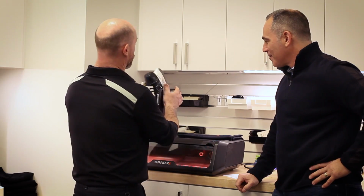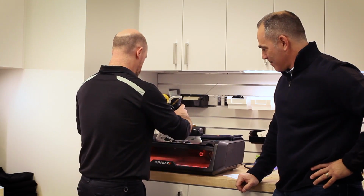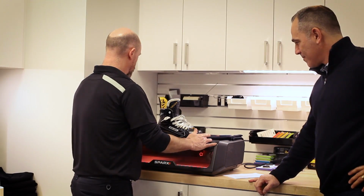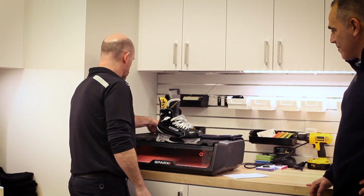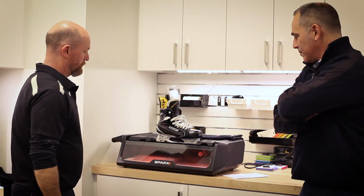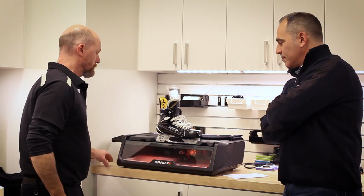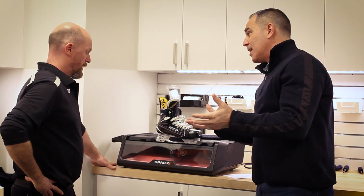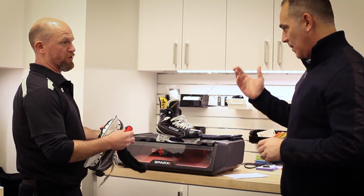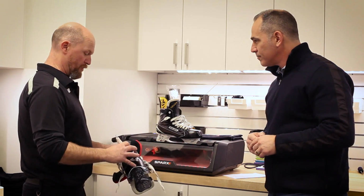So normally I would check for straightness with my rule, but I think these are pretty good. Just try to center it in the clamp. Get the sides in. It usually defaults to 4 passes. I'm gonna move it down to 2. The amount of passes is dependent on how much you need to clean it up, right? Yeah, and these look pretty good. You can leave it on 10 if you're really trying to get rid of some material. But it only needs a few in this case.